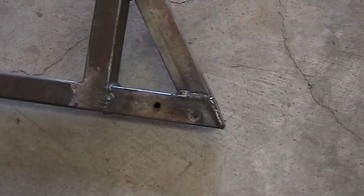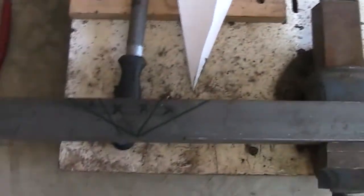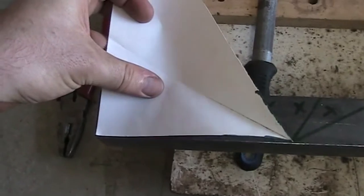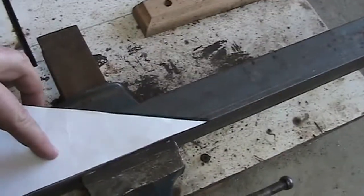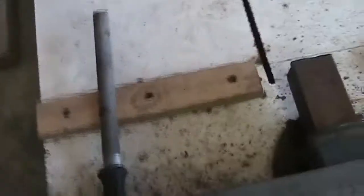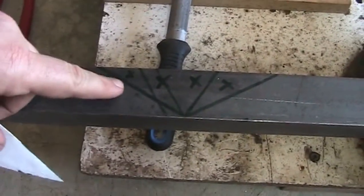Having cut them off, you can see how I jury-rigged the cut lines to weld it back up. I'm going to make the new brackets out of angle iron instead, since the bolts on the lights aren't long enough to bolt through the old ones. I'm using my triangle trick again — trace your triangle, rotate it, trace it again, and that tells me where the last cut needs to be. Then fold the paper, trace the two angles, and there's the new weld line when I bend it.